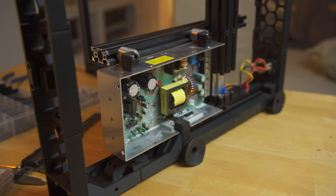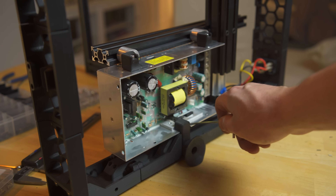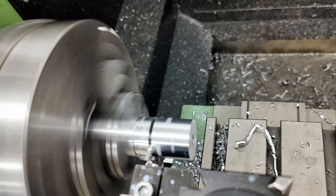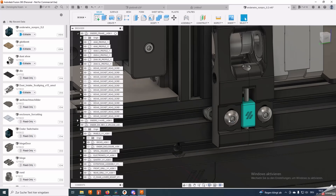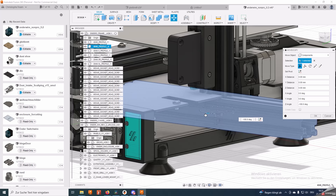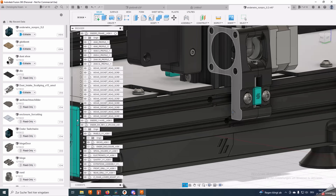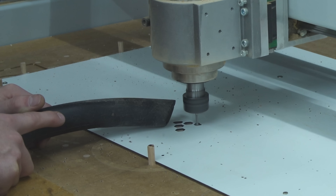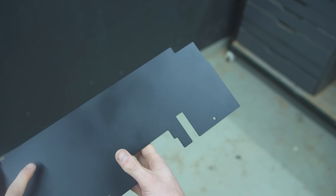The original Ender 3 power supply is bigger than the one in the drawing, so I had to cut out the power supply area and made some 22mm spacers. In case it isn't obvious enough, I really can't recommend doing this to your only printer — once something goes sideways, you better have a well-equipped workshop or a friend with a 3D printer. The second issue I ran into was that the T-nut from the motor mount was interfering with the socket head screw which fixes the extrusions together. The solution was to rotate the extrusion by 180 degrees. With the extrusion rotated, the whole location is now further back and doesn't interfere with the motor mount, though I then had to add drop-in T-nuts to compensate.